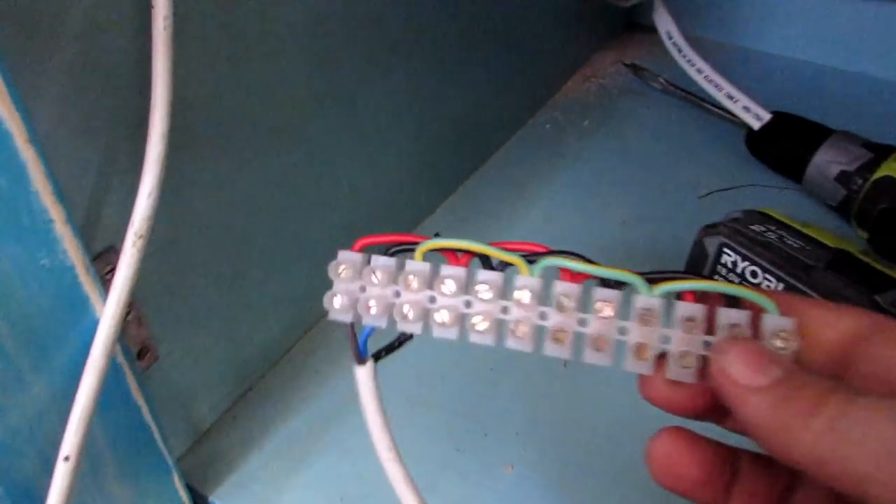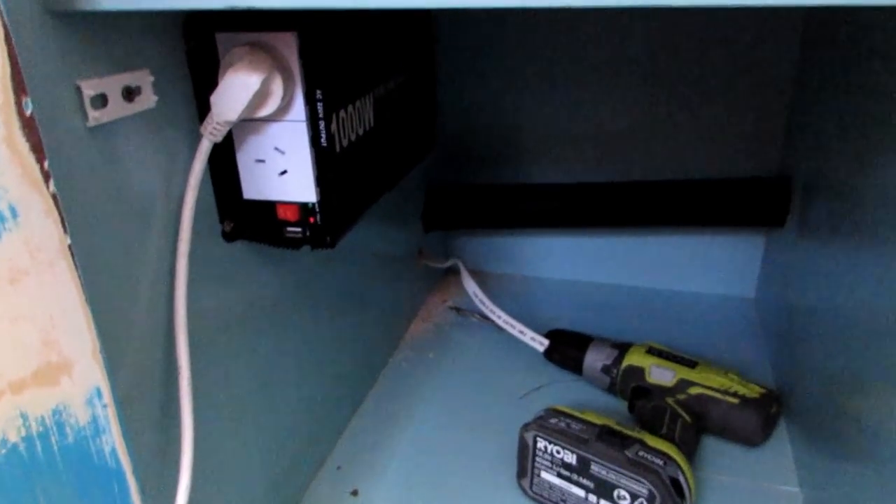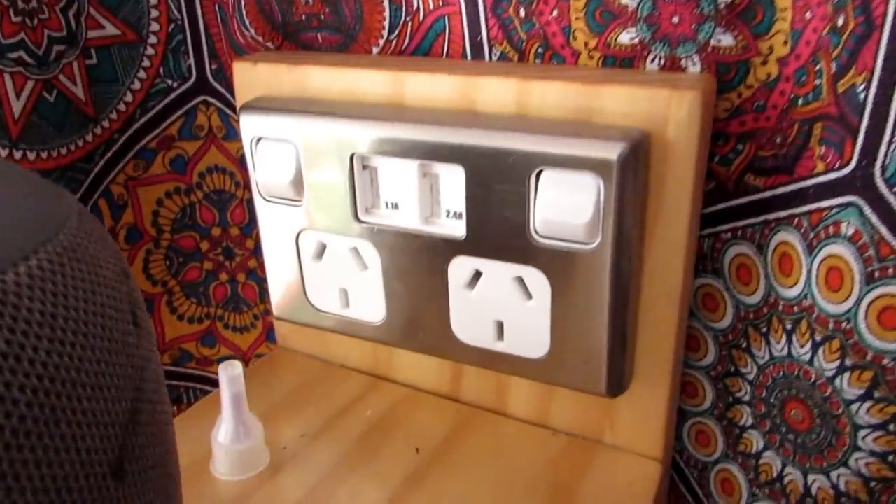It's kind of out of the way, it's still going to get the airflow, and the cable I've run down here is going to come up through the back of the cupboard to our rated chocolate block. We're wiring that off our inverter - I've put a plug into the inverter and this will feed three different live areas for 230-volt stuff, so we can charge laptops. Our plugs also have USB chargers, so that's feeding down through the cupboard as well.